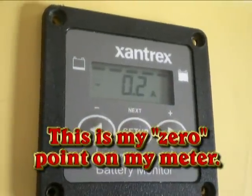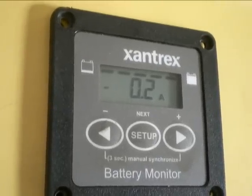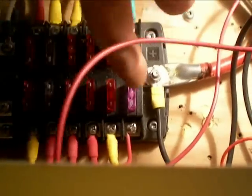For the test I unhooked the solar panel, so now I'm reading minus 0.2 amps — that's just phantom draws on the system, so that's my zero point. I've taken one of the lights, plugged it in — they're just push plugs. There's a switch in the line with two lines coming out. These aren't the proper color codings but one goes to positive and one goes to negative, down on my fuse panel. The power line I put on a 3 amp fuse.